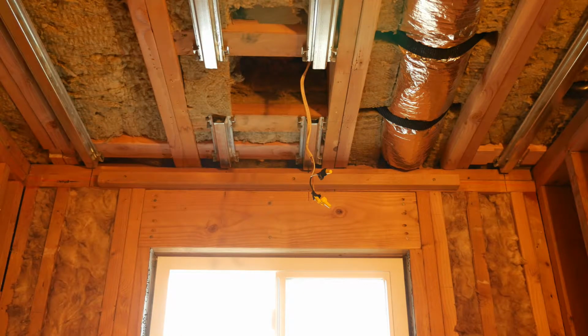And so far, from what I can tell, all 3 spots are at 60 1/4, which means I'm probably going to cut the drywall at about 60 inches, so I have about 1/8 of an inch gap on either side, and I'm not trying to force the drywall up onto the ceiling and risk damaging it.